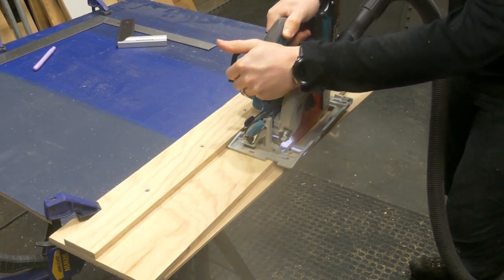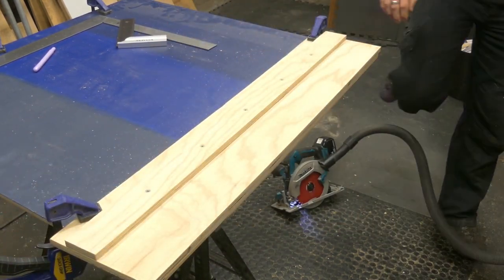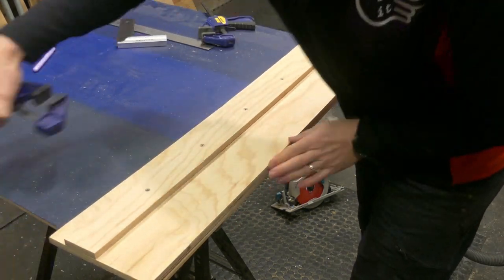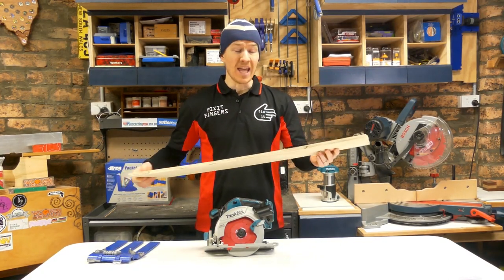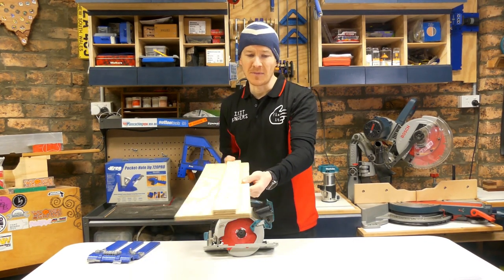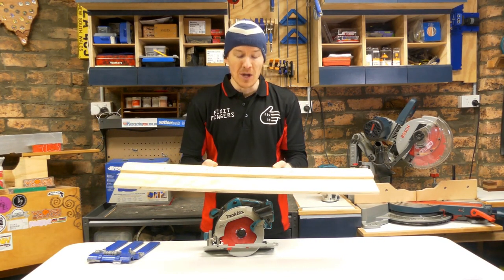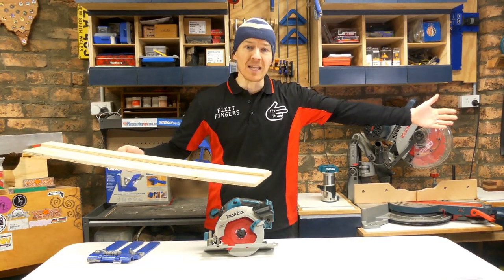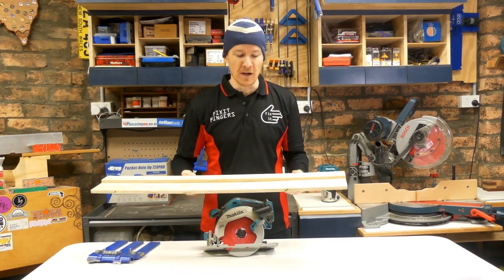Why would you want this on top of the square cut? Because you can do things like angles, and they're going to give you chip protection which will give you cleaner cuts on good sheet ply. The poor man's track saw allows you not only to cross cut — you could of course cross cut on this, it just is a bit of extra setup time to get it perfectly straight. This is going to allow you for rip cuts. You could of course make this four foot to eight foot long and either half or completely cut a full sheet of plywood if you wish.